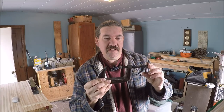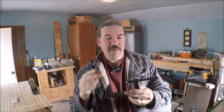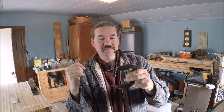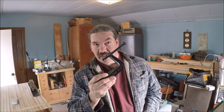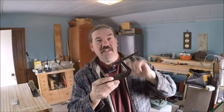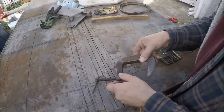I put it in an electrolysis tank - I'll put a card up here so you guys can check out that video. It was in there for a few days, got pretty much most of the rust off. This could be applied to anything - broken off bolts or seized fasteners. I work on old stuff and this is something you're just gonna run into. These things been put together a hundred years ago and maybe never been apart since. Good preparation is really the difference here because this thing was welded in there - it would not move not even a little bit when I first got it. But I got it cheap.